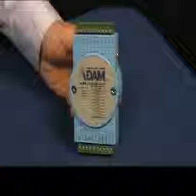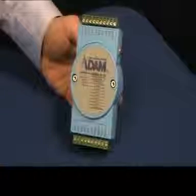All of the units also come with a DIN rail mount or panel mount. When you look at the ADAM 4000 modules — the 4100s, the 4500s, and the 4501s — these modules are a perfect choice for establishing a very low cost, effective remote I/O system. The modules only use two wires for communication to hook up to either the controller or to a 485 device. With all those different options and great features, the entire 4000 series of I/O and communication modules are a great choice for all your industrial environments and applications.